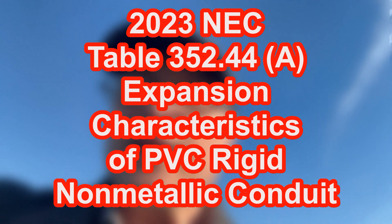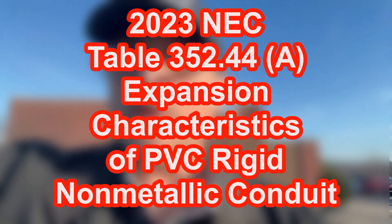Now if we look at the table — go to your NEC code book — and if you can see that behind me, it's really squiggly wiggly over there. That's because when it was installed and it gets hot, that PVC conduit is going to expand and it's got nowhere else to go. So it gets all squiggly wiggly. Then when it gets cold, it contracts. So if that PVC conduit behind me is expected to expand or contract a quarter inch or more, we're required to put in an expansion fitting.